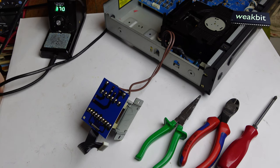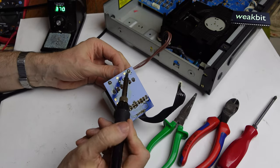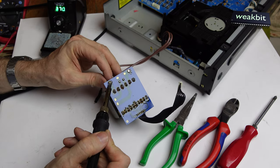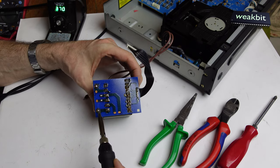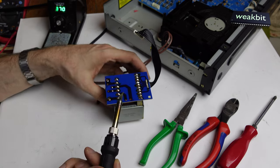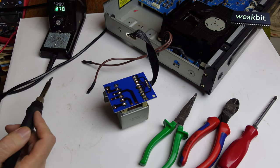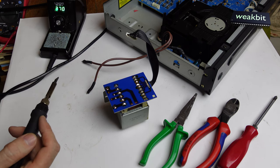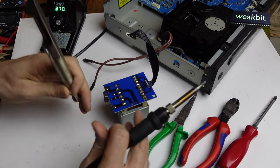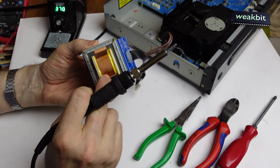In the next step I would like to desolder it with my soldering iron - you can see it here, 370 degrees. It's very easy to come out. I think I desoldered the transformer completely, because the thermal fuse is maybe on the other side - not on that side, here. If I cut it here I cannot find it there. I think it's more here.